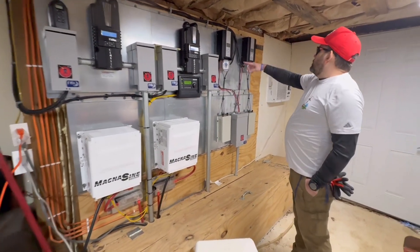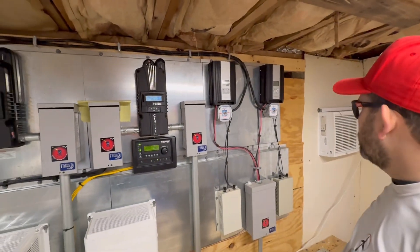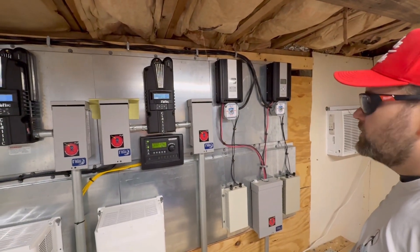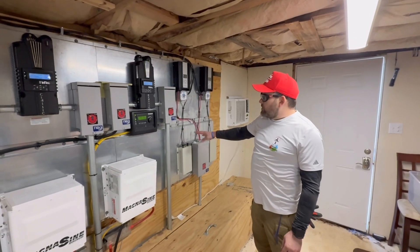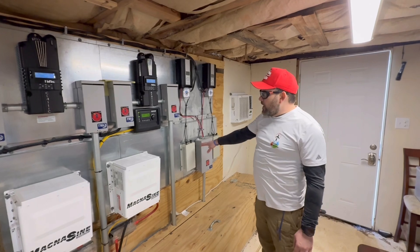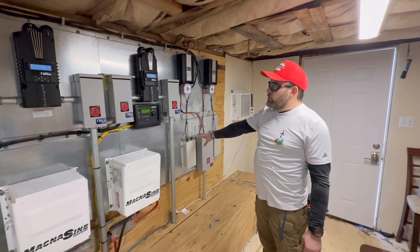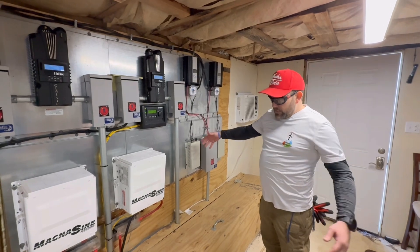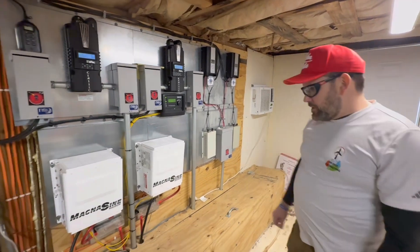It's got two wind turbine systems on this. It was put on there like I said 10 years ago and still in operation today. They've got a dump load built in to let off any excess heat — excess power goes to the heat coils in there, so that's really handy because that helps heat this basement area up too and helps keep an ambient temperature.